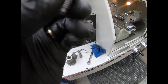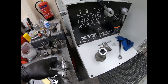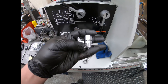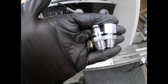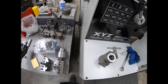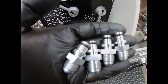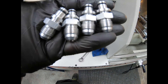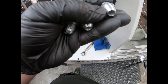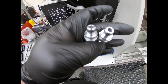What I've been learning today is doing this second half — going from that to that. Obviously there's an O-ring on there which you wouldn't have. I've gone through four of these so far trying to get it right. We had one with too big a chamfer on the end, one that turned it down too much, and then these two were good — they turned out right.